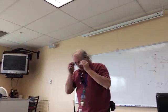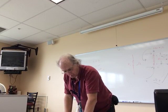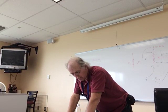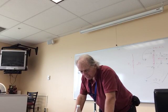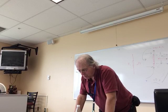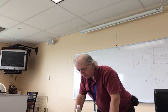Now, if you go on to the next page, you will see voltage dividers, 8-15 has three resistors, and then notice that they have a resistor off to the side on the bottom. Again, that's a small resistance, 1K and 10K. So that 10K will affect that 1K, and it'll look parallel. The 1 milliamp will want to split between the two. It's not a bias circuit, it's actually a load circuit.